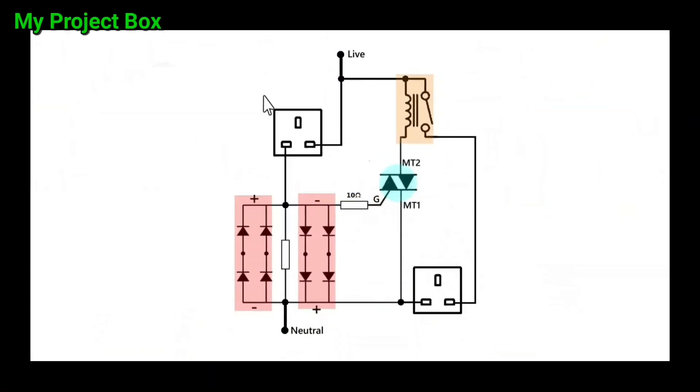This is the actual schematic of the circuit that I came up with. I needed something extremely simple and compact that could easily fit inside the power strip. This is the master socket that the load is detected from, and this is the slave which the relay switches the live to. On the neutral side there's a bunch of inverse parallel diodes — these ones facing up, these ones facing down — which create a volt drop of about 1.2 to 1.5 volts if a load is drawn from this socket. So on the neutral side there is a volt drop.